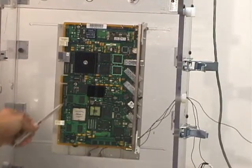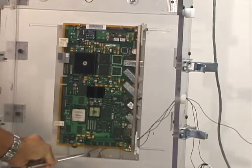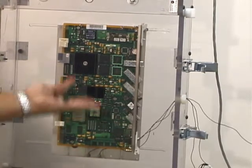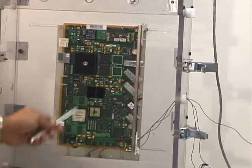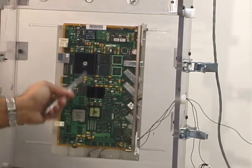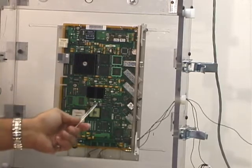In this particular instance we've put the sensors at the upstream of the devices that we are concerned about, as well as putting the sensors here at the inlet of the wind tunnel in order to be able to quantify the flow that's coming in. By measuring the flow upstream of the component we are able to analyze the system in such a fashion that we know exactly what the requirements are at the location of the device, and that's very, very important.